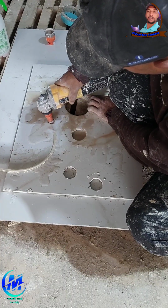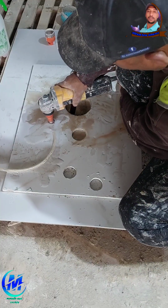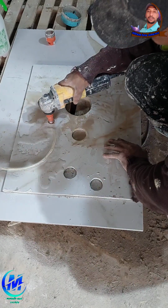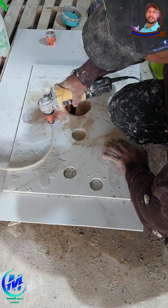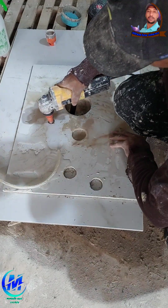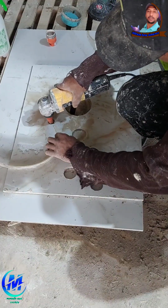Point 4. Tiling walls. A different game if you're extending porcelain onto the walls. Note that vertical tiling needs different care. Use extra strength adhesive made for wall applications, because gravity isn't your friend here. Start tiling from the bottom up, using temporary metal guides or wood strips to hold tiles in place. Always double check that your lines are level. One wrong tile will ruin the vertical symmetry.